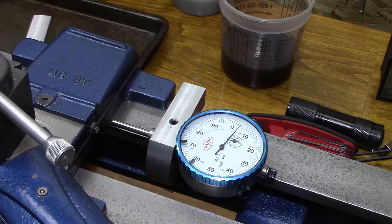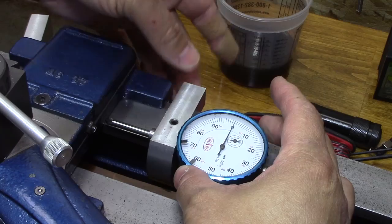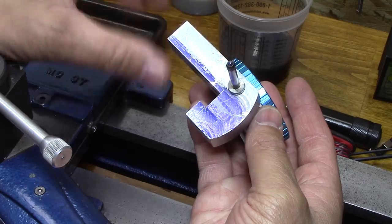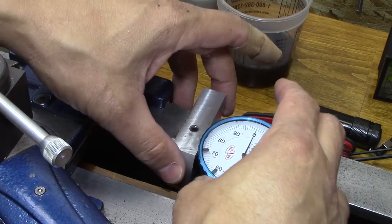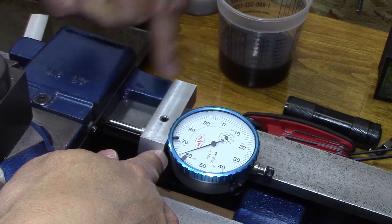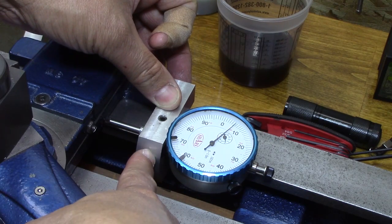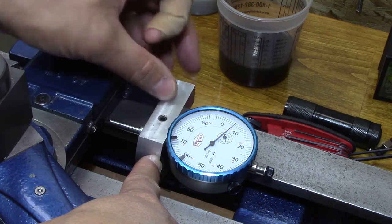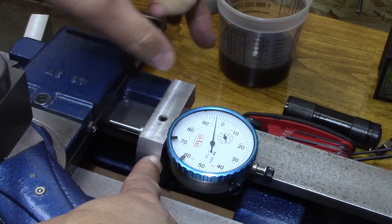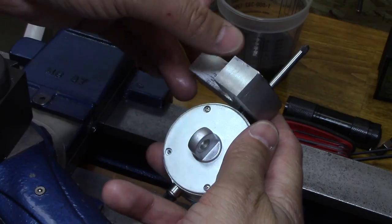I'm still kind of messing with designs, figuring out how to get this dial indicator working on the back. I'm using that J-piece — when I was messing with it, this was just a tester piece, but I kind of like it. So I think what I'm gonna do is cut off this part so it can slide a little bit closer if I need it to, and put in a set screw for the dial indicator. The mechanical stop on there will work, but I probably won't use it — and I'll put two rare earth magnets under here. We'll go do that and see if it works.